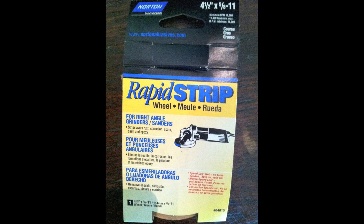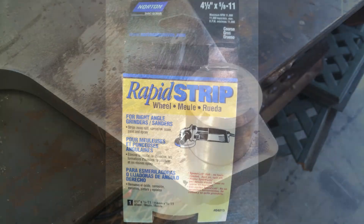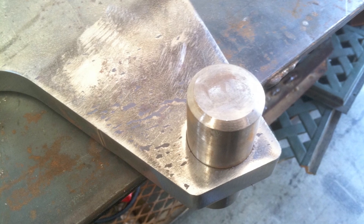A tip for you first: we had to clean some hot rolled mill scale because some of these parts are going to black oxide finishing, and that's not going to stick to the hot rolls. My machinist friend found a really good way to remove that. Grinding wheels make rough scratches and sanding discs load up, but this Norton wheel called Rapid Strip — it's blue — works really well. You can go to my website to see the part number and a picture of it.